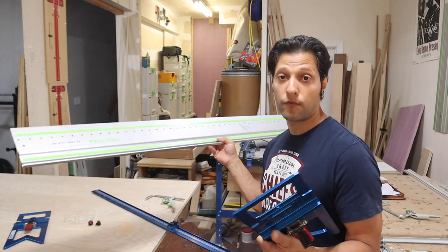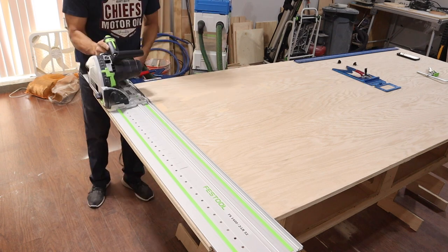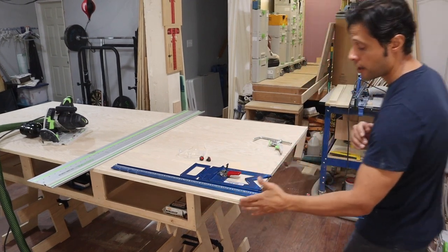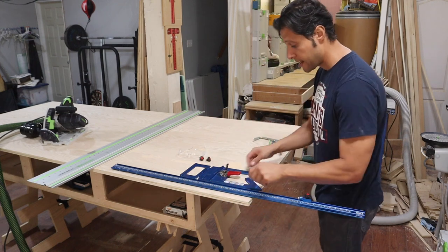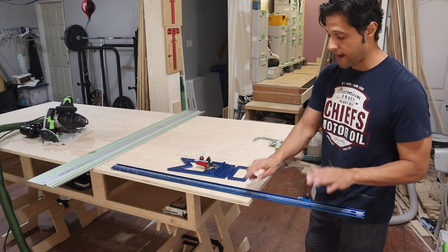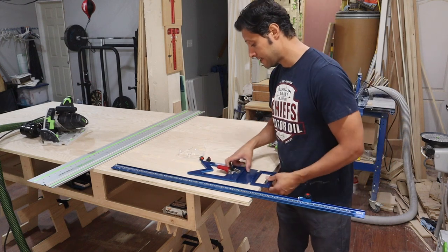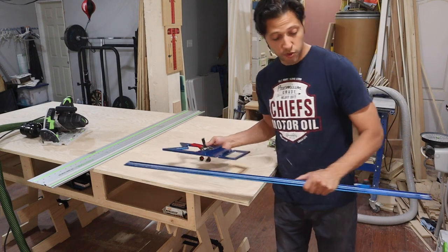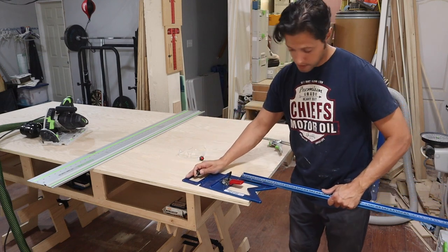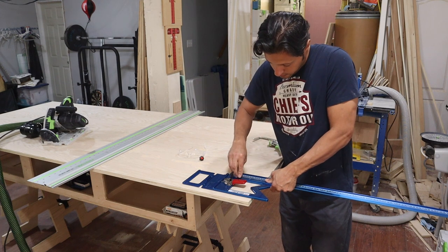You can still use this as a drop-on adapter for your parallel guides. So let's make a cut real quick. I've already ripped this edge — this is my reference edge, ripped it straight with the track saw and my track. And from there with the guide rail square, I butted it up against there and made a quick 90-degree reference cut. So this is my square edge right here. Now I need to cross-cut a length of 915 millimeters.